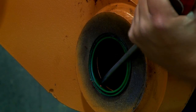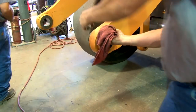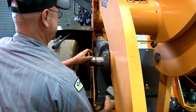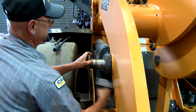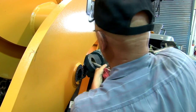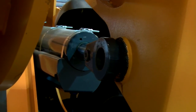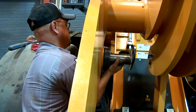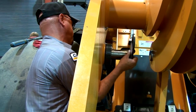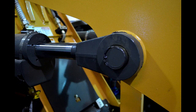After removing the bucket, we also remove the seals and the bushings. For the wheel loader, we need to make sure that the grease fittings are on the inside of the loader arms, so we will reverse the yokes and pins from the boom lift. This is what they looked like originally, and here is what they looked like after we changed them.